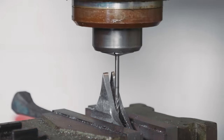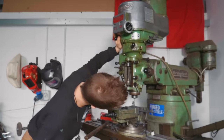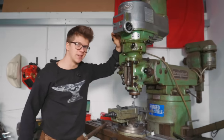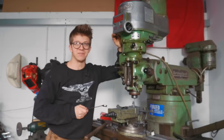Well, since I'm reckless, and clearly don't seem to mind the ridiculously stupid idea of having a cutter in a collet only an eighth of an inch, we're gonna see if we can poke a hole through it, and maybe even get the slot for the tang all done on here, with only the fit-up needing to be done on the file. If not, I'm gonna have to put a drill bit in and file the whole thing out.